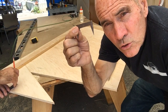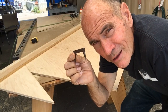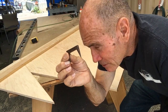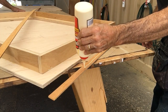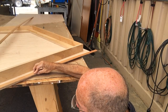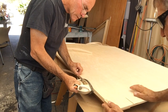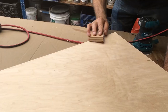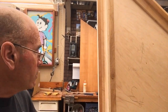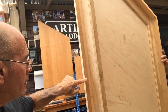We've got this little cool tool — it's like a little wedge that clamps the pieces of plywood together. It works really well; I bought this about 35 years ago. Along the edge, we used half-inch plywood but we want it to look a little thicker, so we're stapling on some quarter-inch material to the edge, and then we're going to edge band it with some iron-on edge banding. The back side of each panel has a backer piece that holds the standoff piece, plus a little piece of quarter-inch plywood to make the whole thing thicker.